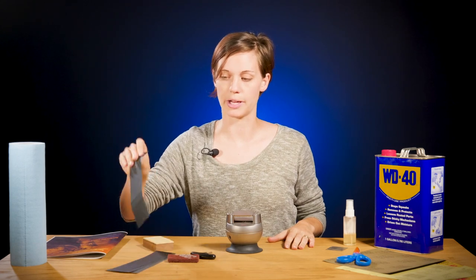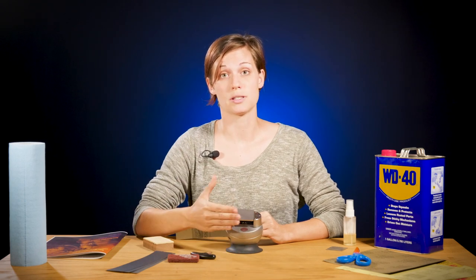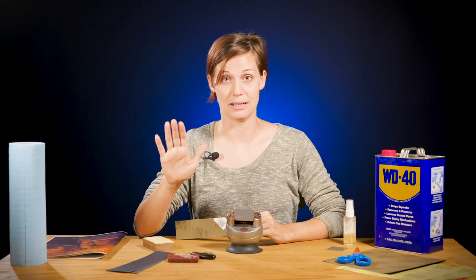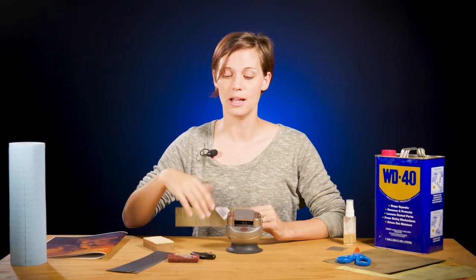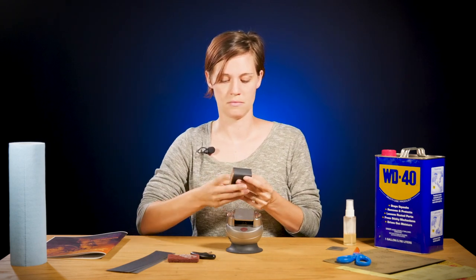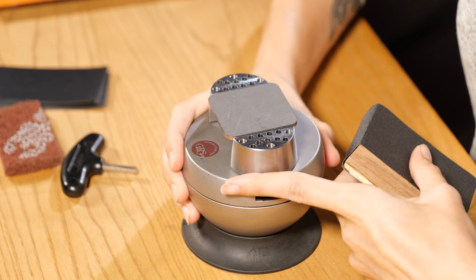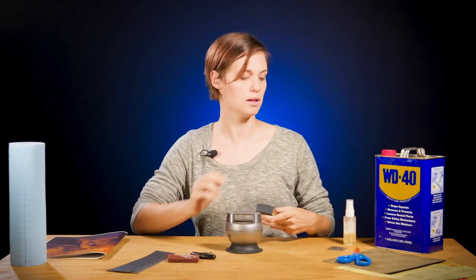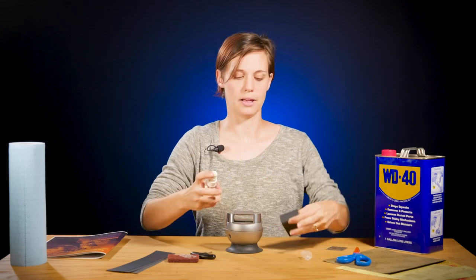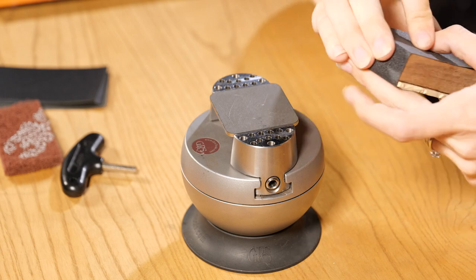I've already pre-cut some strips. I'm going to start with 220, because this piece isn't really scratched up too much. You may have a piece that's not as bad and you can start with a higher grit. You may have a piece that's worse and you might have to start with a file — we recommend not using a file unless you absolutely have to. We're starting with 220, just going to wrap this around the block. I have my piece locked down into a vise — this makes it easier to hold and I don't have my fingers in the way. We're going to spray it with a little bit of WD-40, and I'm going to start at a 45 degree angle.